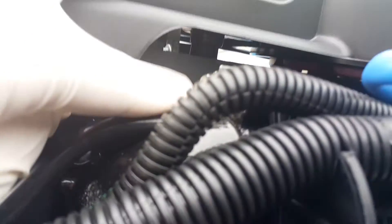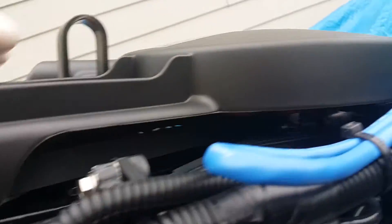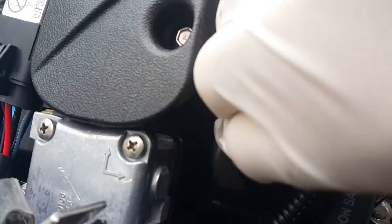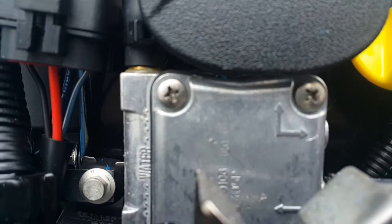Up here is your alternator with a Kevlar drive belt. The Kevlar drive belt looks okay — make sure you check for fraying. The alternator is inside here — you can see the red part of it. It's an 18-amp alternator with a flywheel. That's my oil filling port, which I'll be using shortly. That little thing with the arrows is your mechanical fuel pump — that's the backup to your electrical fuel pump, which is due to Coast Guard requirements. That also looks fine, at least visually.